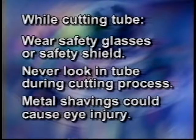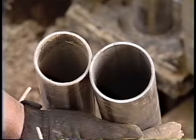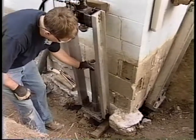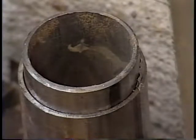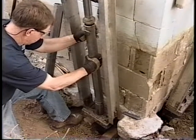While cutting off the tube, make sure that you wear safety glasses or a safety shield. Never look in the tube during the cutting process due to the updraft in the tube — the large amount of metal shavings could cause serious eye injury. Now that the tube is cut to the right height, install the grip-tight reinforcement insert tube inside the last tube. The correct way to install the insert tube is to measure the distance from the top of the piering tube to the coupler in the ground of the same tube, then cut the reinforcement insert tube three inches shorter than that distance. This will allow you to insert another tube should it be needed at a later time.